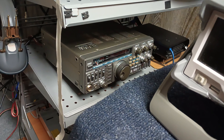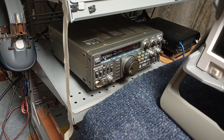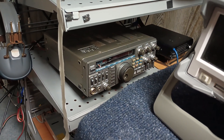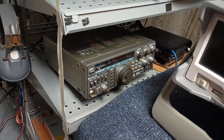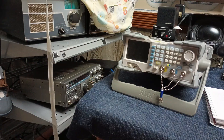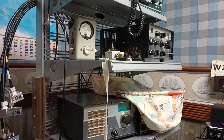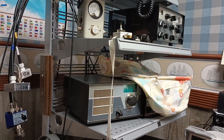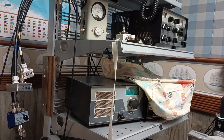I've never seen it discussed and never seen a display of it until yesterday. I keyed down with the Yaesu and tuned to the strong signal on the Kenwood — nice clean tone. As I tuned up, the signal went away with a little 60-hertz noise from power supply leakage. Then, tuning up a couple of kilohertz, lo and behold, there's another carrier from the Yaesu. It shouldn't be there — it's spurious. The watt meter can't indicate frequency; it's not a wave meter. It can't tell us that a mismatched antenna caused significant energy to be created off-frequency.